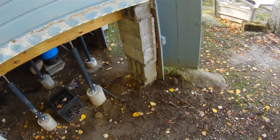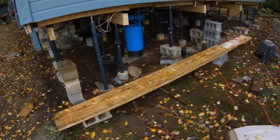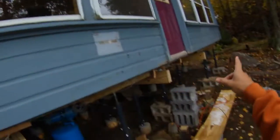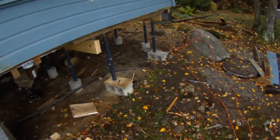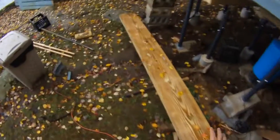We will give you updates as we progress along the project. Today we have the front cut off, we are going to be putting a new sill in — this is a 2x12 — and we are butting it up against these boards, basically underneath here so all the weight from the windows and sliders we are putting in is even. I got a half piece here that is going to join with bolts to the next piece in the middle to make it all one long post. I am going to be digging five holes today for concrete pillars. These are just temporary jacks so the weight is off and we can work. Hopefully if it doesn't rain we can get these posts up so the house can rest on those.